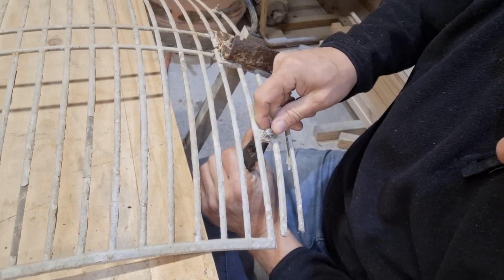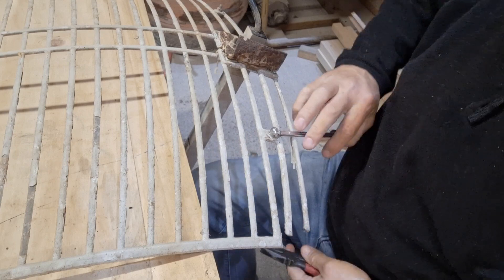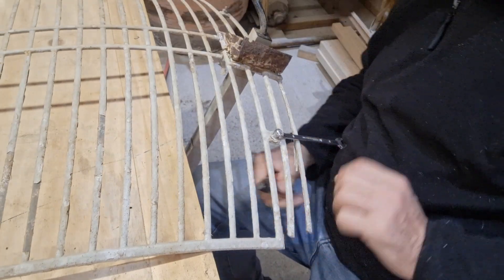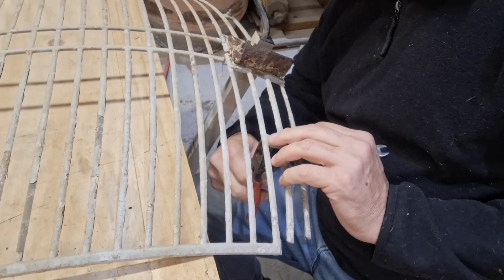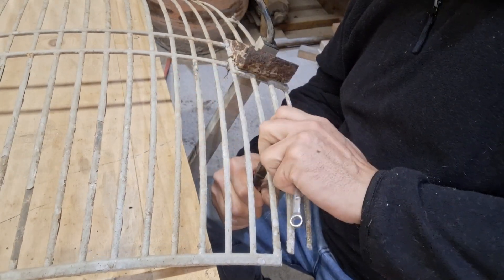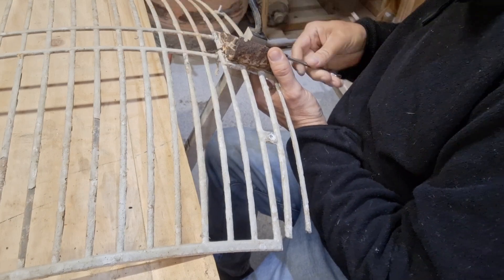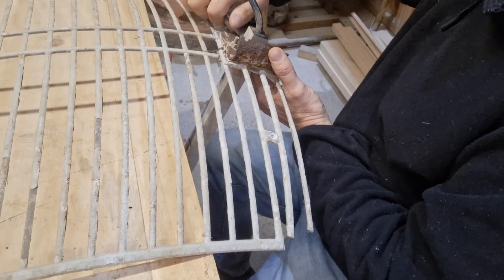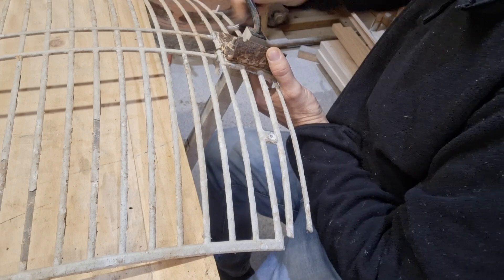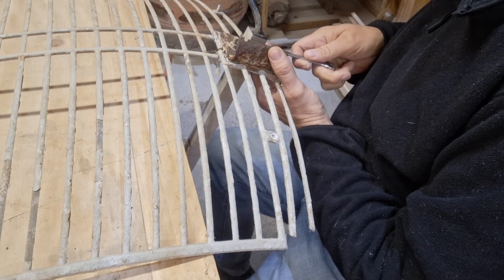This is going to be kind of fun to make because it's a parabolic antenna — it's the shape of a parabola. This one's actually a complex curve; it curves in this direction and in that direction. I did actually try this antenna last time we were up, but I could only get like 8 dB of signal, which is not enough to be useful. So with luck, making the other half of the antenna will get me in the ballgame.